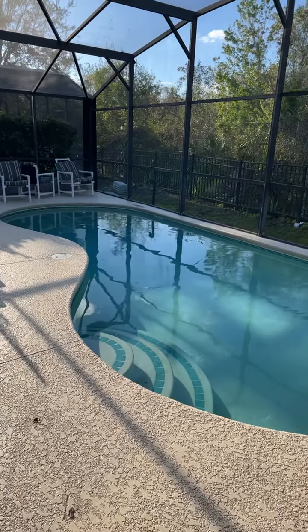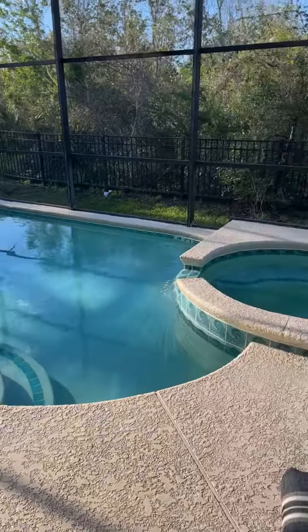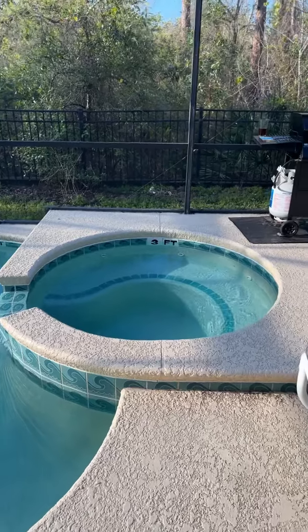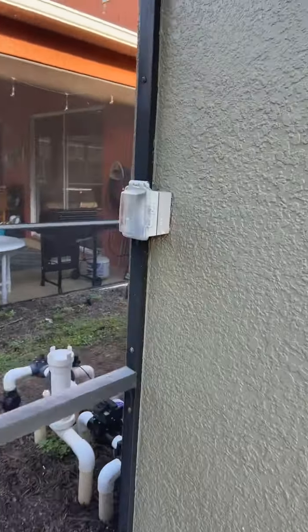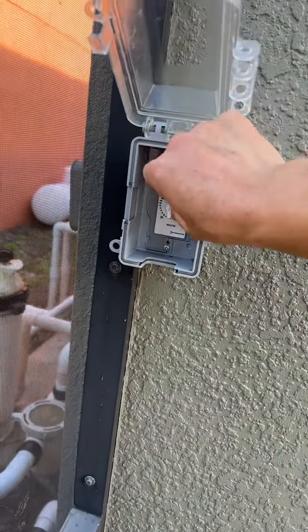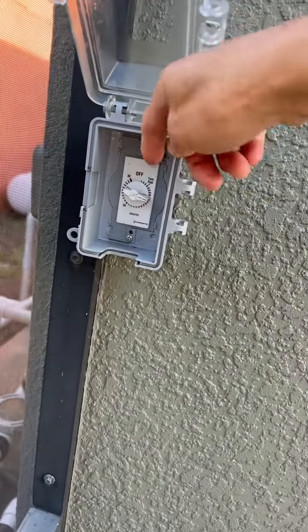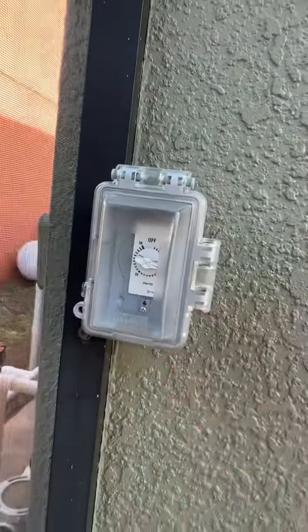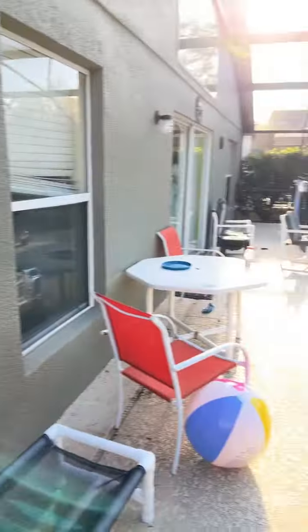When the pool is being heated and you want to switch to spa heating to get a higher temperature in the spa, you can turn on the spa by turning on the timer. Here is the timer, and you turn it past a certain point and wait for a while.